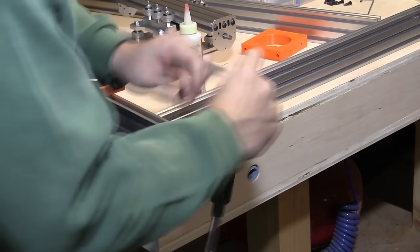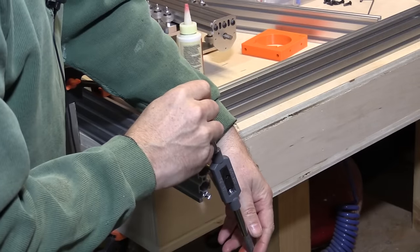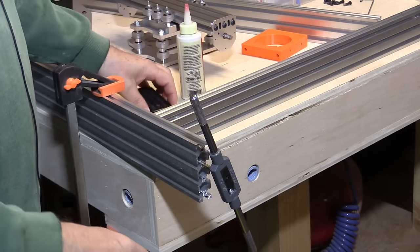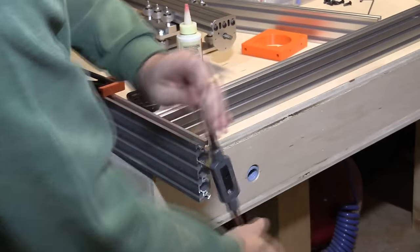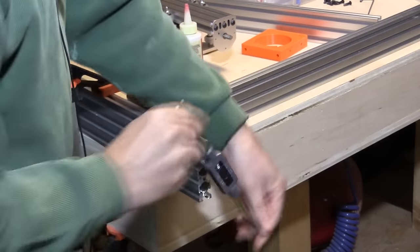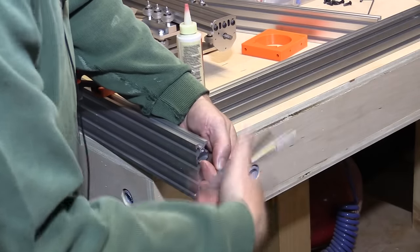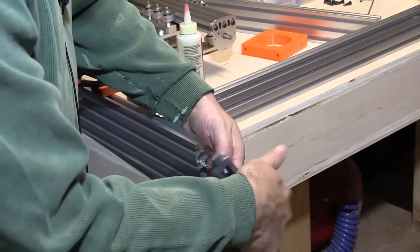Remember when you're going in — like I said — one turn or one and a half turns in one direction. Make sure you're not wobbling your bench and causing all your other extrusions to fall over. My bench is not screwed to the table bottom yet, so I hope it's not creating too much vibration there. Anyway, that's the second one done, and again, you should be able to just easily unwind it with your finger. That's the second M5 thread cut.